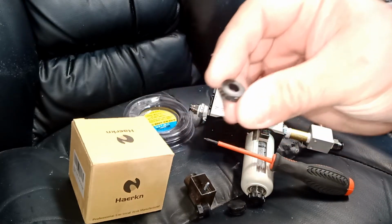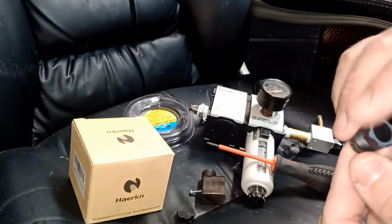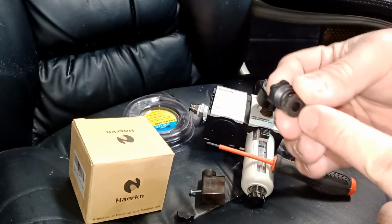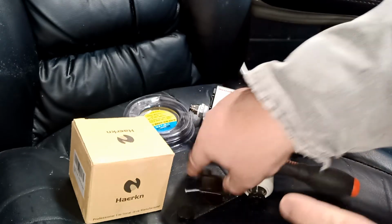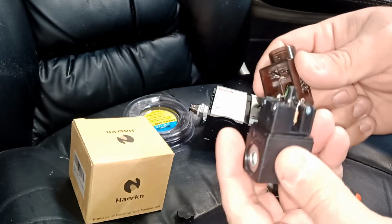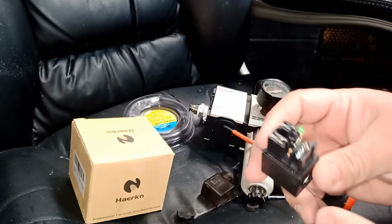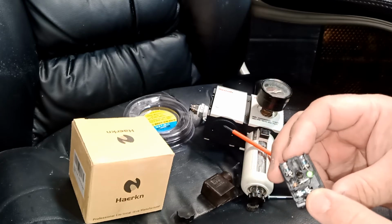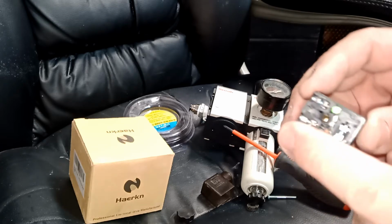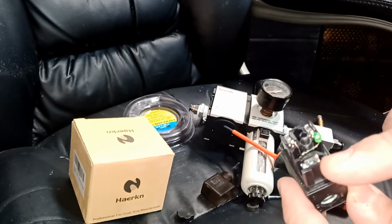So here's the washer. Basically you're going to feed your wire through here, something like this, through this guy, to the washer, just to lock it. Then it goes inside here. It's going to come out and it's going to attach to this guy. So here there's three. There's a ground. There is this one for a red, and this one's going to be for the black wire. So red, black, and we can hook a ground.